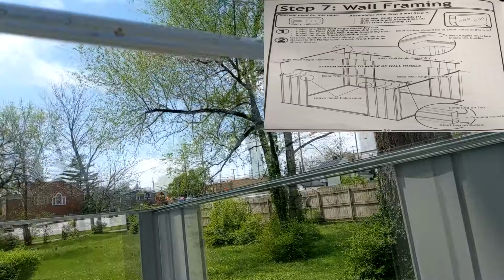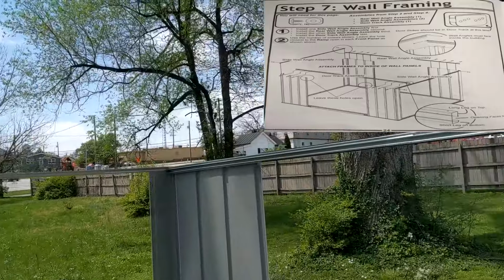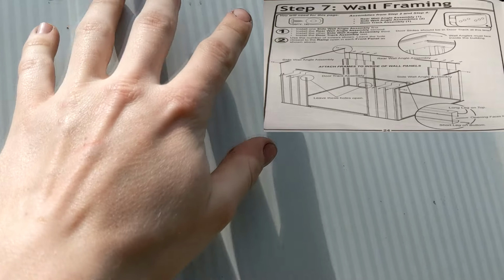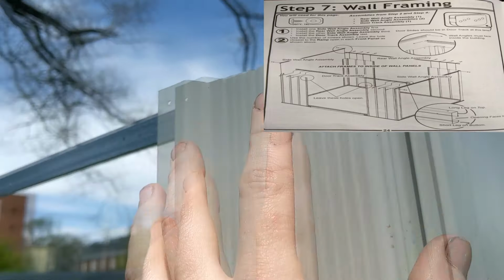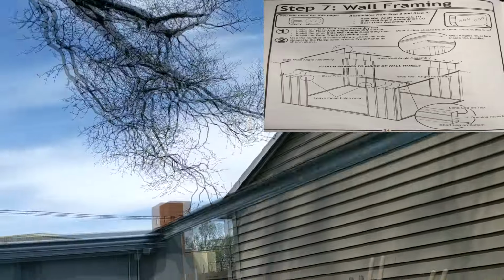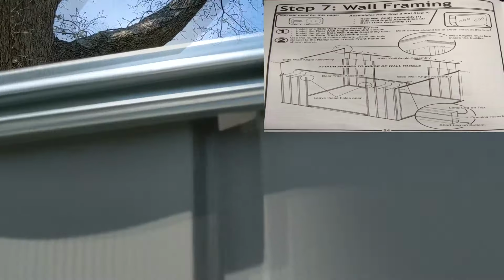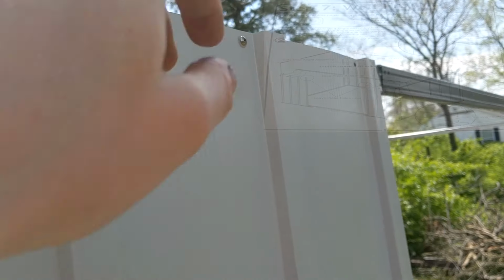We went ahead and kind of skipped ahead and started putting the frame pieces on, so that's all the rear wall channel, side wall channel, and the front door track that we built towards the beginning of this. So it's good to go ahead and put those on. You're just going to use, on the back, a total of 4 of the self-tapping nylon washers, and then 1 on each side for the side channels, and it's going to be the same for the other side. And then for the front door track assembly, you want to make sure that the bottom is facing down, or the shorter lip is facing down, and then that the brown piece is facing out. And then once again, you're just going to line up the screws out here, and you're just going to put 3 on the inner holes.